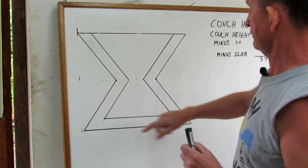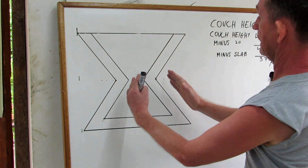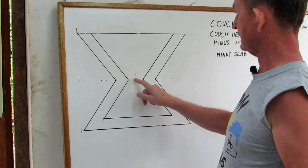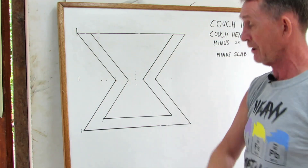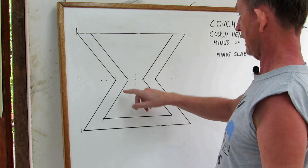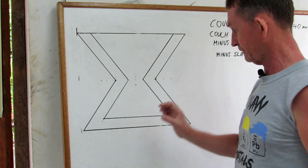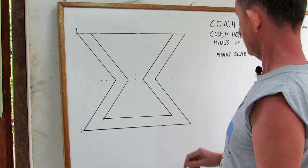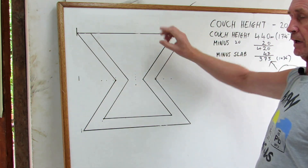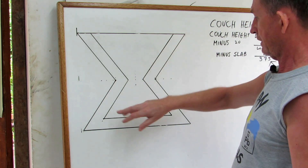Make up a box of 440 by 375 for setting out the leg shape. Then decide what angle you're going to come in at - I'm using measurements rather than an angle. Get your center line both ways - always get your center line when doing anything. I measured over 80mm on each side of center, then drew a line from there to there, so it's 160mm from one side to the other. The width of the leg itself I'm making 40mm. On the top there's no solid piece going across - we'll add something for fixing later - and we'll sandwich the pieces together to make the hourglass shape.